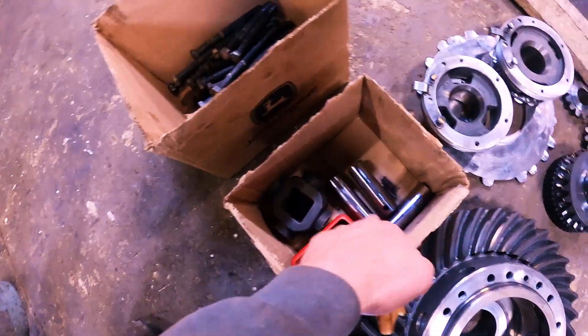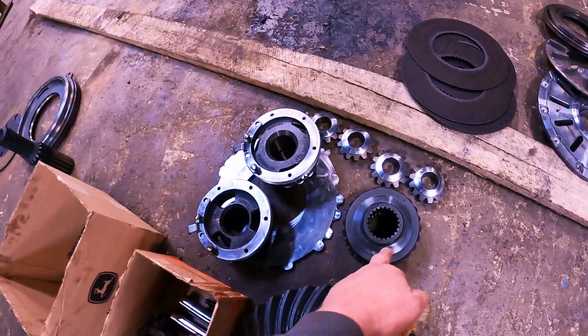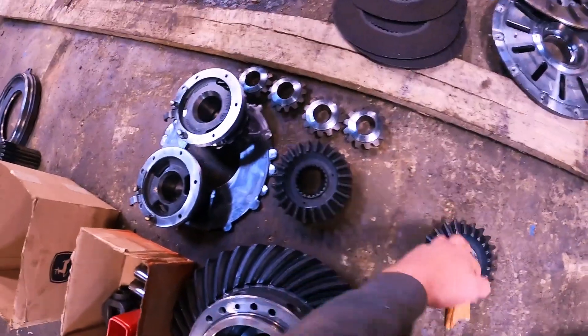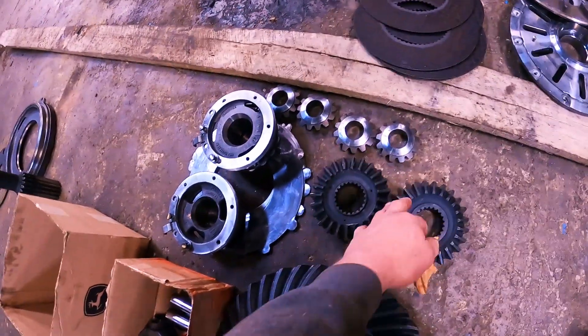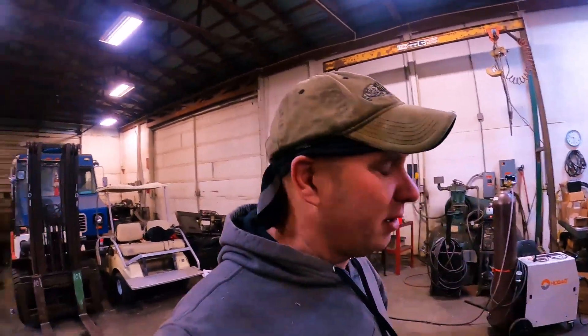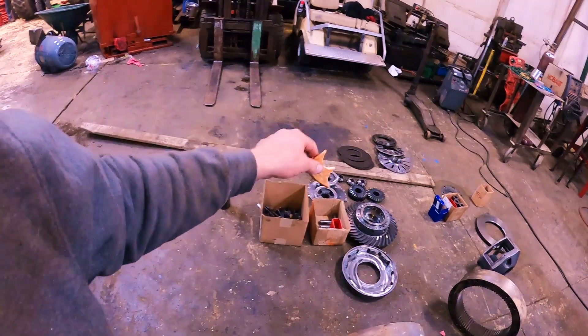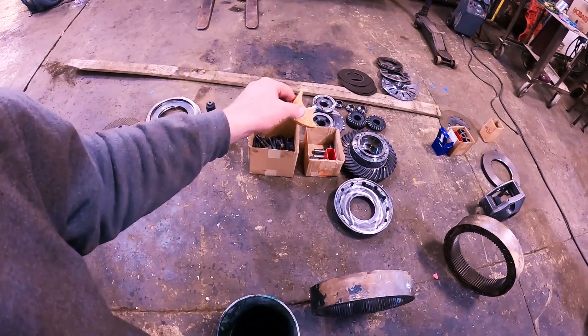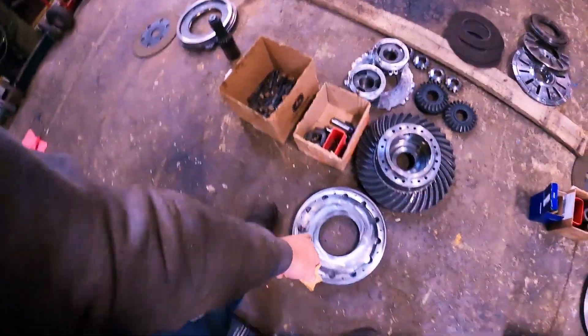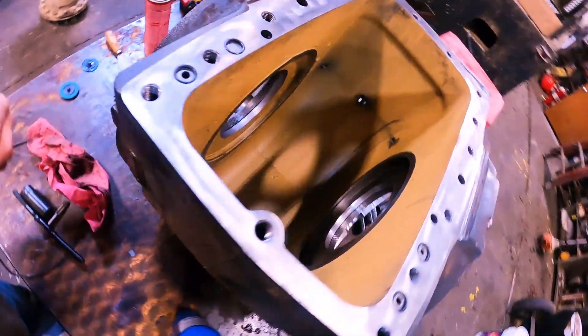There's a cross, there's the shafts for your spider gears, here's the little spider gears. The spider gears are sitting there spinning around, and they don't really move until you make a turn — so the inside tires can take a shorter turn. But when you want diff lock, when you want to lock her in tight, this piece bolts to that piece all inside the pumpkin or the hog head.